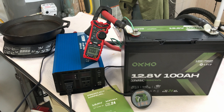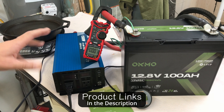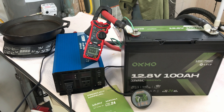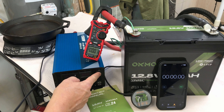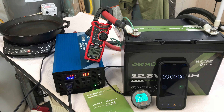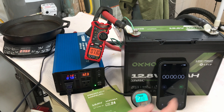I've got the Alpha 1500-watt pure sine wave inverter and an induction cooktop with a pan of water. We need somewhere around 1,200 watts to get 100 amps out of this battery. I also have an amp clamp set up so we can see what's coming out of the battery. We'll start with medium temperature, set it for 900 watts, and go from there.